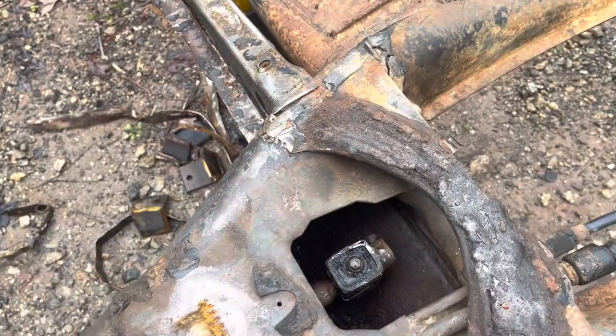I'm probably going to stop doing the pan replacement at this point until the next video. But while I've got this opportunity, I'm going to show how to remove the shift rod from the center chassis tunnel — I should have showed it in my disassembly video, but I'm going to show it now. I want to take that out before I sandblast it. As for the heater handles, I'm going to replace those along with the levers and cables, so I'll just leave all that in when I sandblast it — if they get screwed up, I'll buy new ones.